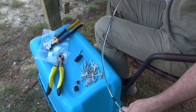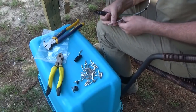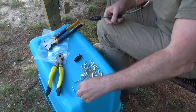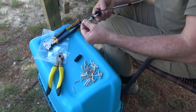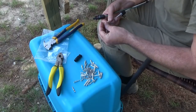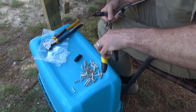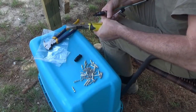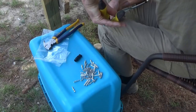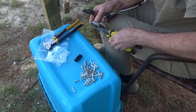This is 10 gauge wire — the print isn't very clear but it's heavier wire that I use to connect the solar panels to the electronics. One important tip: don't ever forget if you're doing this to put the end caps on first to screw in, otherwise you'll never get it connected. I've learned that the hard way a few times. I know I don't have the proper tools for crimping these.